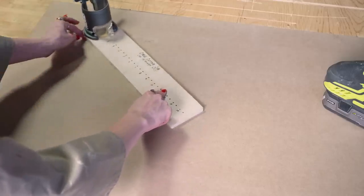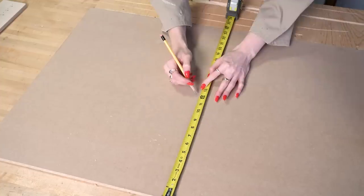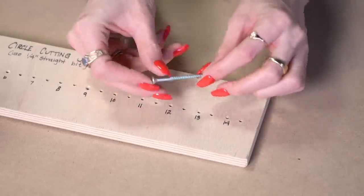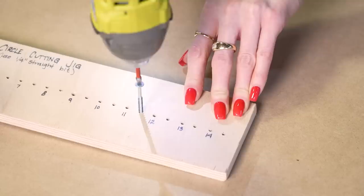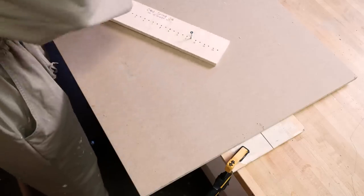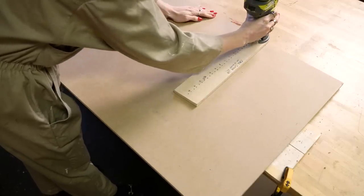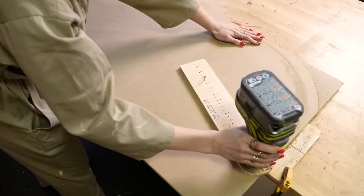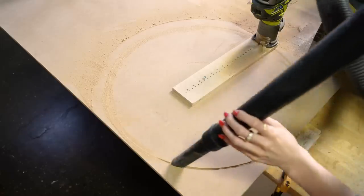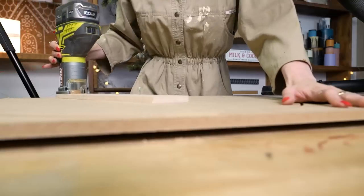By replacing the foot plate of the router with this homemade jig we can now use the board as a pivot point. The website says the tree collar is 24 inches wide and since my board is also 24 inches wide, I'm going to mark our radius at 11.5 inches just to be safe. Once we put the trim on, that will bring us to 24 inches. Now that our trim router is on the jig, the first thing I want to do is take a screw and drill that into the radius marker into the MDF board underneath. I'm using a scrap piece of wood to elevate the MDF so the router bit doesn't touch our work table. To make the cut I hover the router tool over the wood, start the tool before I plunge it into our MDF, and then pivot the router around the circle one time. This creates a lot of dust so shut off the router and vacuum the path clean, then set the depth of the router bit down about an eighth of an inch and repeat the same process until you get through the full depth of the board.